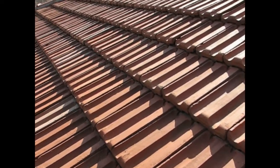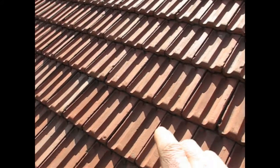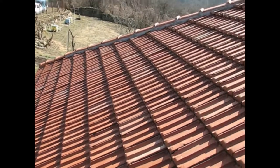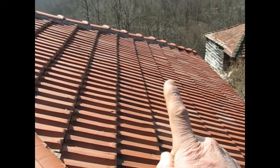Walking around, I'll make sure that all the tiles are one type and that they're all interlocking. Many times, because of lack of money, you can find roofs that have more than one type of tile. A roof with more than one type of tile is always going to have problems — they're not interlocking, the wind will come and shift them, blow them off, and that's where leaks start. You want to have one type of tile throughout your whole roof. It is possible to have a different tile type on one slope versus another, but still the whole slope must be one consistent type. Very important.